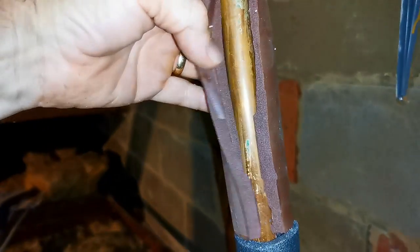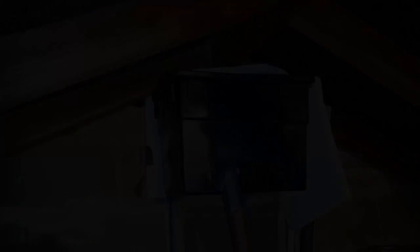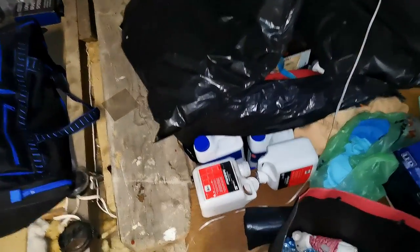You must have a 22mm feed pipe and the boiler must have an overheat thermostat. The most concerning part for me is this tank that has got hardly any insulation, so there is a possibility of freezing in the winter, which would be dangerous for the system. Also, lofts can be extremely hazardous — you cannot walk on the insulation or you are likely to go straight through your ceiling into your bedrooms. You can only step on the joists, and quite often these days they are covered up with insulation. If there are boards laid down, sometimes they can be loose, so do be really careful.